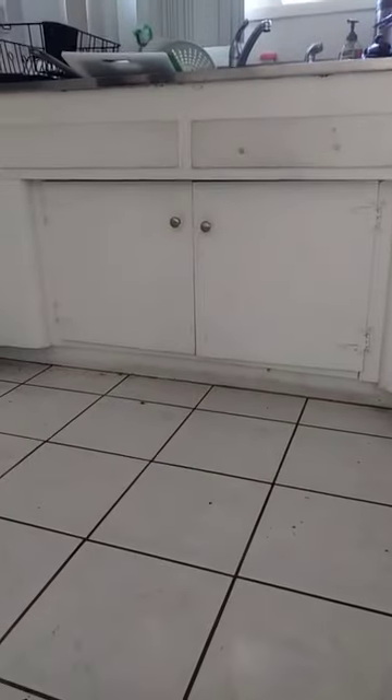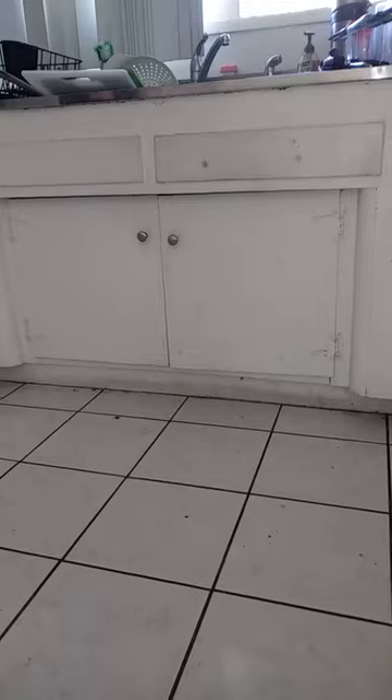Popped it out through the cabinet there underneath the sink — my house is kind of a mess right now, you'll have to excuse me — but underneath the sink there's a tee on the half-inch cold. I just went straight over into the cabinet with that and elbowed up a little bit, popped it out over there. Looking pretty smart. Mounted it with some unistrut, just to be cheeky, and I'm pretty pleased with how it turned out.